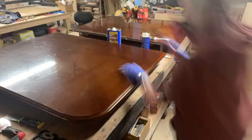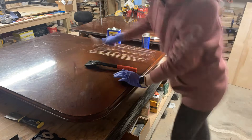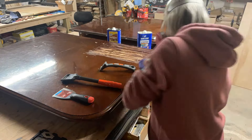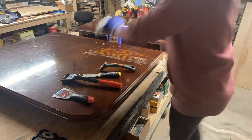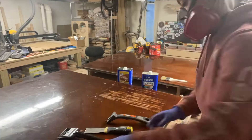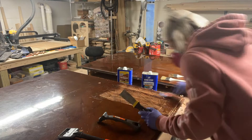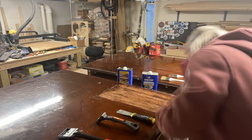I put this on about almost 10 minutes ago and you can see it's starting to work. Another five minutes and I will start to give it a good scrape — I put it on the rough scrape side. Here you can see me very determined to make this scraper work, but I did not like it at all. It was very sharp so it grabbed everything in one spot, but it wasn't smooth or wide enough, leaving veneer and stain in between the scrapes. I did not recommend it. I recommend the wide scraper that looks like a spatula — that worked the best and is definitely the go-to.